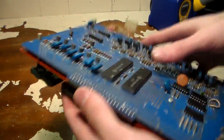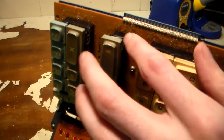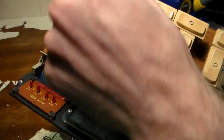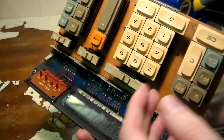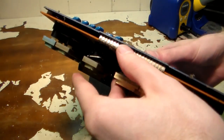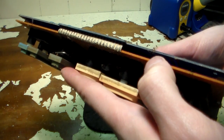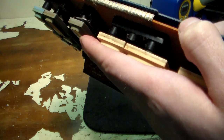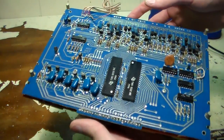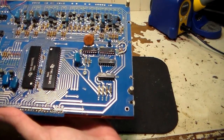Here's the back of the readout — you can see the neck where they filled the tube with gas. And then there's this row of solder joints at the bottom that translates through a really strange ribbon cable to the buttons. So technically you could take the screws out of this orange board, flip it over, expose the bottom side of the main logic board, and desolder the ribbon cable if you wanted to work on the board. Also, the bottom side of this board is red — and the contrast is just so neat. The bottom side of the AC to DC converter board is also red.